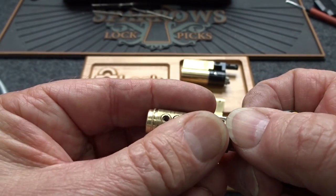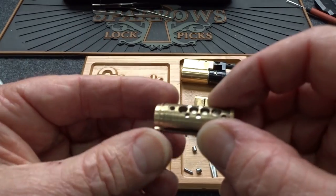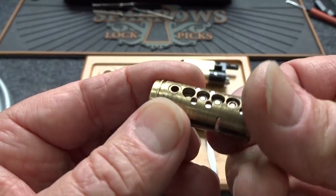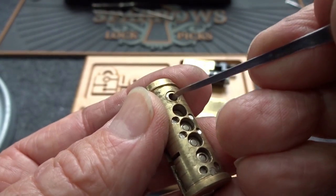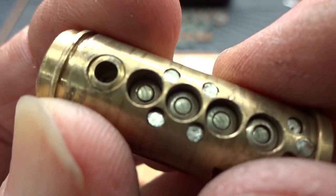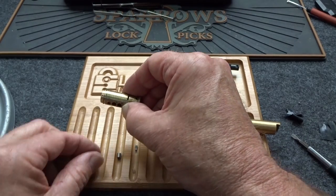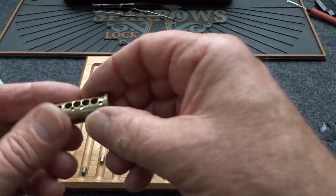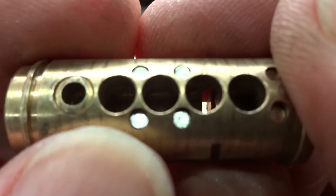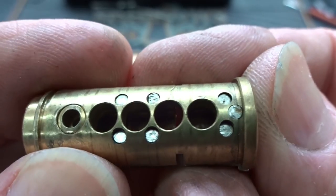Let's look at the pins upstairs. There's our spring-loaded pin five inner. The outer pin isn't even coming out — it's fixed. Pin five outer doesn't have to be picked; it's probably flush with the bottom. Its only job is to hold that spring — it's even non-magnetic. Pins four, three, two, and one — that one does not want to come out. His only job is to hold that magnetic pin. Look at all the counter-drills — anti-drill pins. What a high-security lock. You're never going to drill this thing out.